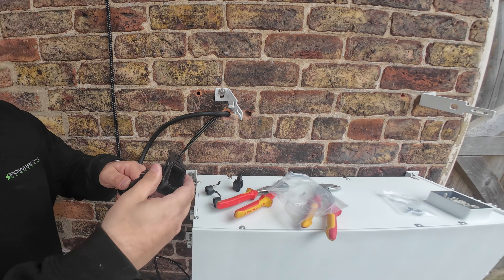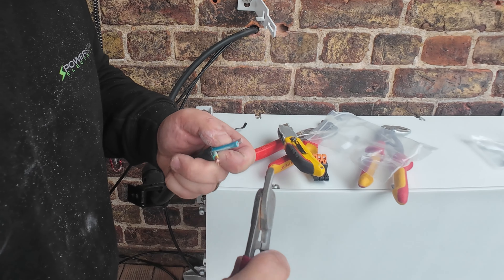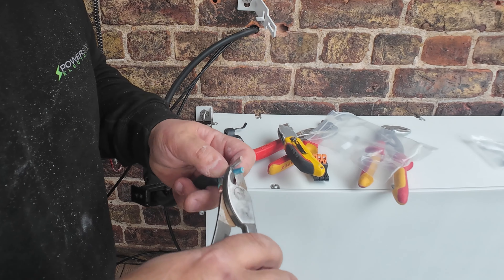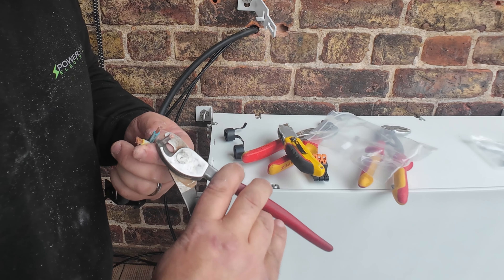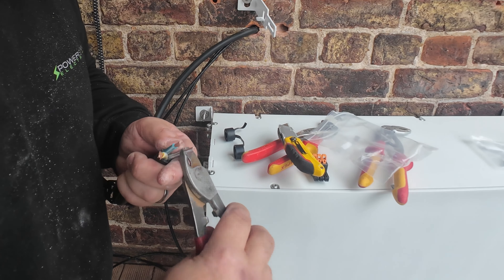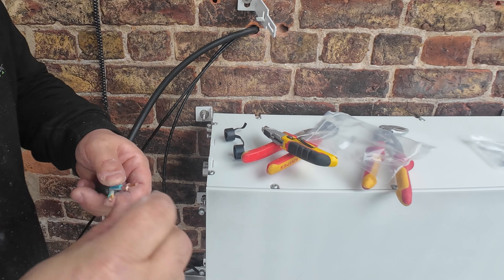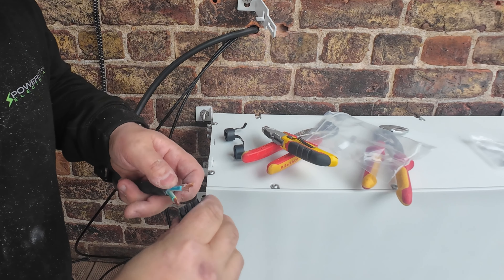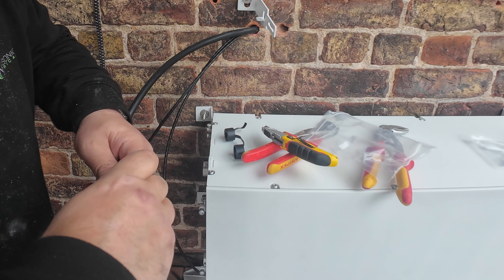This is the connector for the power cord. It comes with various options in terms of weather sealing, which is nice. Based on the cable size you may be using, you've got some flexibility. We've got a 6mm H07 going in and you can see it being stripped ready to wire into the connector. Keep the stripped lengths as short as possible to maximise wiring room inside the back body of the connector and ensure we maintain water tightness. This being an outdoor location, we do not want moisture getting into any of the terminations.